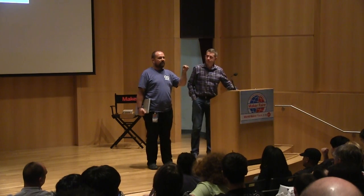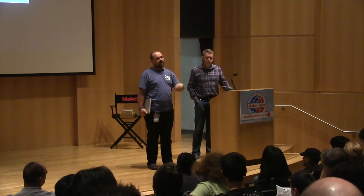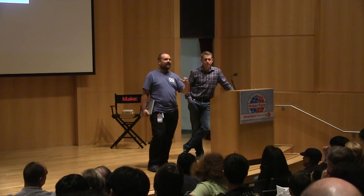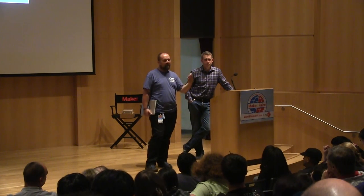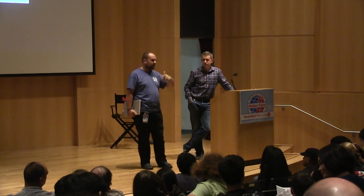The question is about the decision of not incorporating Ethernet into the Due. Actually, one of the reasons why it took us a little longer to do the Arduino Due is that we waited for this processor to become available, the SAM3X, because the SAM3X has Ethernet on board on the chip. We didn't want to launch 25 boards the same day. So we start with one so that people can start adopting the technology, and there is a board with native Ethernet coming out, which is going to be very efficient because the same single chip does Ethernet, USB host and all the other things.